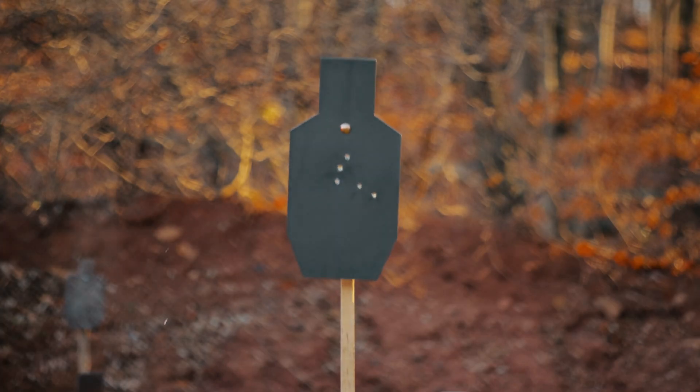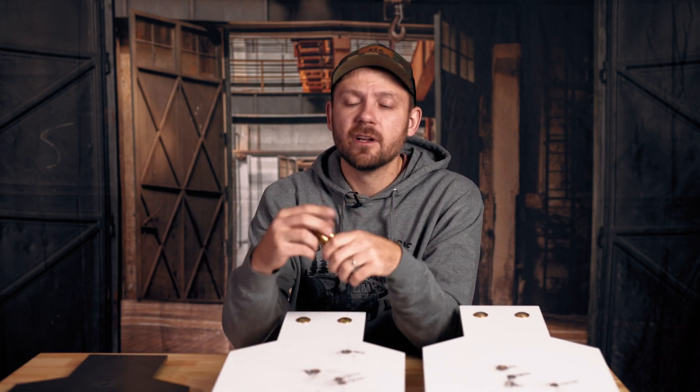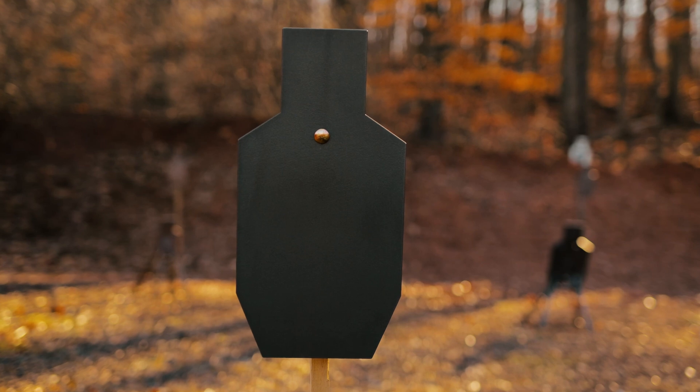The Genesis 3/8-inch AR-500 option is made from domestically sourced AR-500 material. The Exodus plates are manufactured from a Swedish AR-550 that is sourced directly from Sweden. While the shape and size are very similar, the steel is wildly different. The two materials begin life in a totally different way — they are not the same makeup or process of refining into the plates that we buy and ultimately cut into targets. The results later show and tell this story.